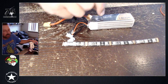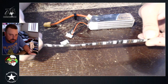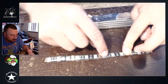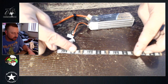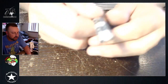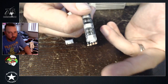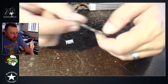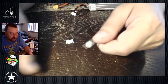What I do is I use a strip of LED. This one just so happens to already be coated with epoxy — silicone. I would definitely recommend doing that if you don't already have a protective coating over it. Go ahead and protect it with either epoxy or some sort of clear silicone. What I've done here is I've quickly prepped the ends. This one actually has multiple pads at the end for different colors, however it's only a one-color strand — you can't select the colors. This is a blue strand, so I'm going to use the B tab at the end and the 12-volt positive at the other end.